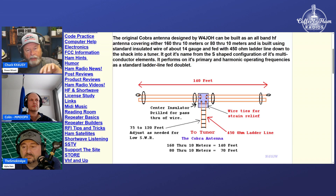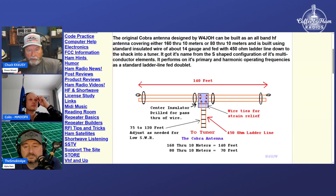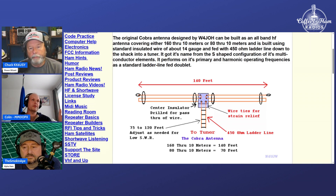I wanted this to be a portable antenna, so the inch-spaced spacers weren't practical. For a fixed home installation I'd use bigger wire — bigger wire is a little more stiff and lays better. As you said, if your antenna needs to be 120 feet to be resonant, if you linear load it, it's going to have to be longer than that. It's not going to be half — depending on the spacing, it might only be three-quarters of that 120 feet.